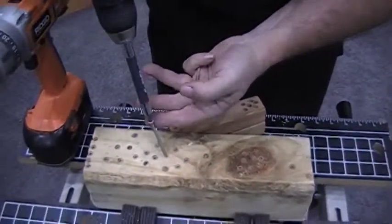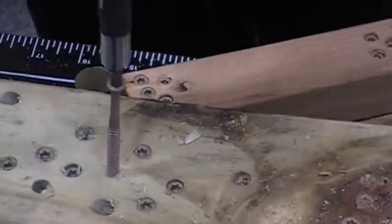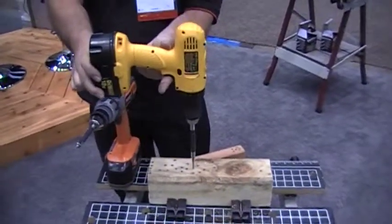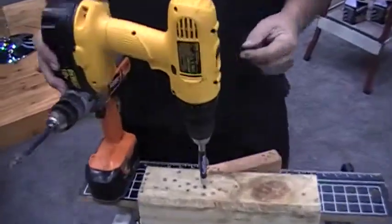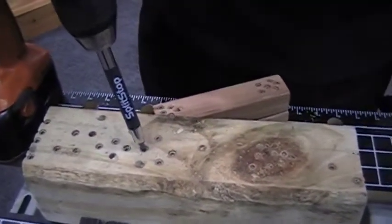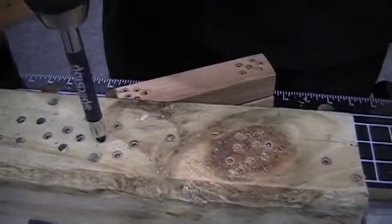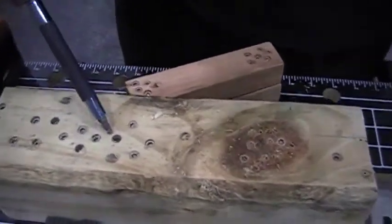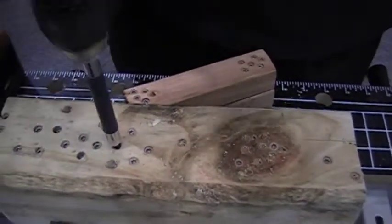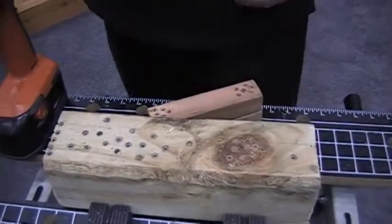You can see as I drive this screw — I'm going to drive this screw with no more than squeezing the trigger and letting the weight of the drill drive it. Now most screws, once you've got it down that deep, you could never move that screw any further — you'd spin the head of the screw right off. This screw will just keep driving as long as you had a long enough bit to do so. Nobody's going to do that in the field, but it just shows you how easy that screw is to drive, and that's a result of that low torsional load thread.